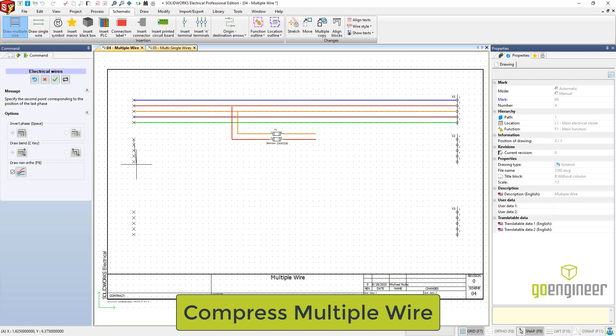So there's the top one already attached. I'm going to do bottom, and then come out horizontal from the top one. You always want to come out perfectly straight from a symbol, at least to start with — you don't really want to make a bend initially, just so that the software sees that it connects cleanly. So I do a click at the top and I'm going to do bottom, horizontal to my green line at the bottom. So top, bottom, and then I decide where I want these wires to go. Maybe I want them to squish down and squeak by. So I'll do a little bit off-centered — top, then bottom — and see how it's actually compressing those down.